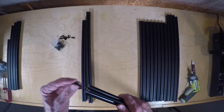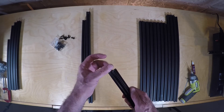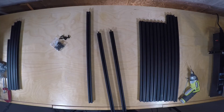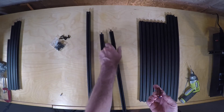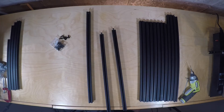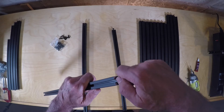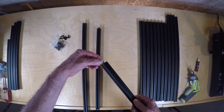We're going to start by inserting the screws into the base rails just to make sure we don't strip any threads, and essentially prepare to put some Loctite on. I'll open the Loctite — it's really runny, so you need to be careful. Have a napkin close by. I'm putting a little dab on the threads and closing it up so it doesn't spill all over the work area. I'm screwing these in so the Loctite enters the threads, and to get them close to the thickness of the rail.